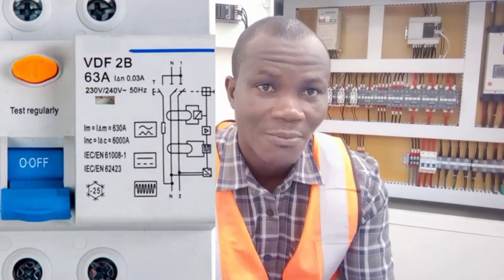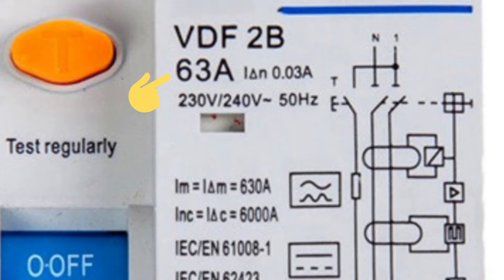Please take note that in my next video, I'll be talking about the various types of MCBs and where to appropriately use them. When it comes to RCCBs, let's take a 63-amp RCCB for instance. The 63-amp rating here only indicates the amount of current that this device can withstand continuously without deteriorating. So on an RCCB, the rating will be shown as 63 — no prefix — and then the RCD rating in milliamps. For instance, here you have 63 amps and then 30 milliamp. So this doesn't feature any type of MCB, and so you know by that that it is an RCCB. It can only work as an RCCB; it cannot work as an MCB.